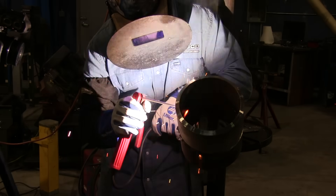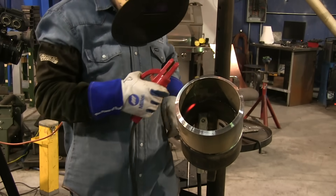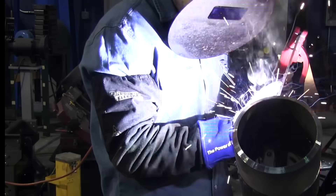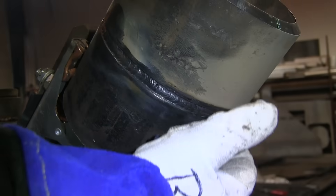If you're trying to just drag a straight stringer in a straight line, it's not going to go well. Also, my eyes are a little older now, and working the bead around like this helps play the light and helps me see where I'm going — helps me line up on bevel edges. Notice that Andrew is steadying the rod with his thumb of the other glove just long enough to get the arc start going and make sure he's staying in the bevel. Then gradually, as the bead gets going, he'll remove that thumb and strictly use one hand again.